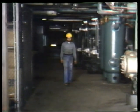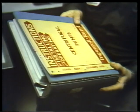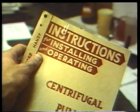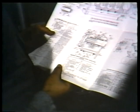How are you going to know when a bearing needs maintenance? Often someone will tell you there's a problem. For example, your supervisor could tell you that a bearing's been running at unusually high temperatures. If you're going to check it out, here are two essential items: the manual from the manufacturer, and your plant's maintenance records for the machine. These are important because they list specifications, clearances, lubrication, and operating temperatures. If you're going to figure out what's wrong, first you have to know what's right.